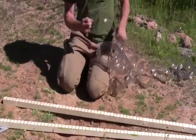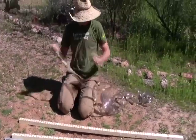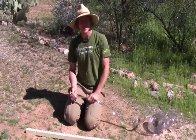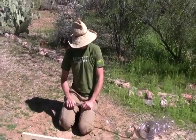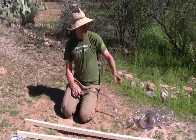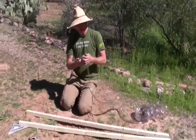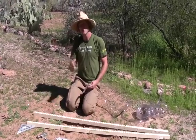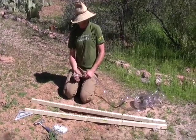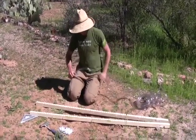This hose ended up being in the shade, but if you put it in the sun for a little while it becomes a lot more flexible. We're using a much thicker diameter hose than you need — it allows for quick fills and is a little more durable since we tend to throw ours around a lot. The weak points on the bunyip are going to be where the last staple is; it'll tend to fold a lot there, and if it kinks the water doesn't move through and you end up not having true levels.